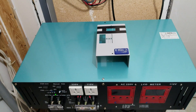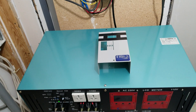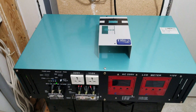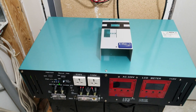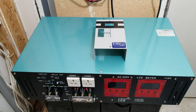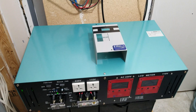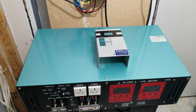I keep getting asked about my fans. I did a brief startup video of these fans but didn't really describe them much. They're super fast, and the reason I got high-speed fans is because when the system was out in the garage in the summer, the garage got really hot and I was having a heat problem. The fans I had were working, but it was still warmer than I wanted — taking a reading of the transformer, it was near 40°C when I was running the air conditioning.